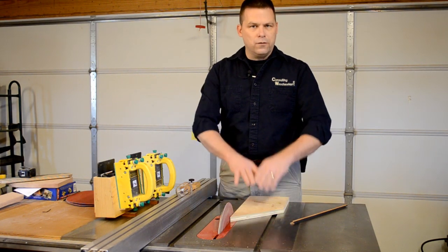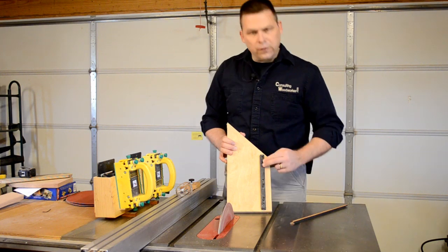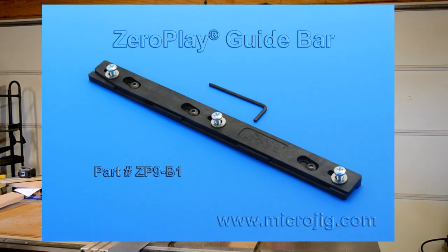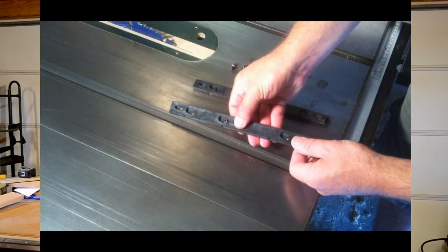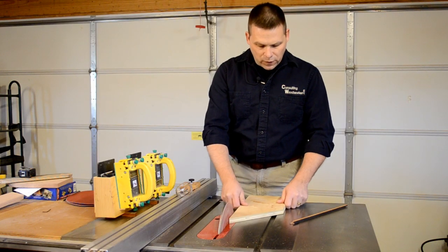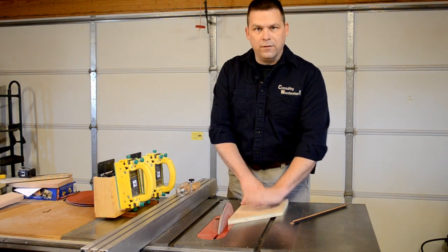I can make one of these with whatever angle I want, and what I use is Microjig's zero-play miter bar mounted to the back side. I like the zero-play because it's short enough to fit on a small jig like this. It's two pieces that move in opposition to each other so it can be adjusted to exactly the width of my miter slot, so when adjusted properly there's absolutely no side-to-side play — it's always going to be very accurate.